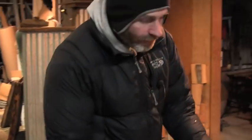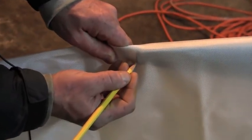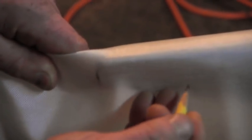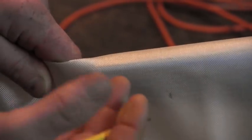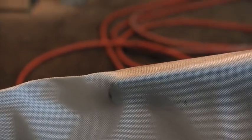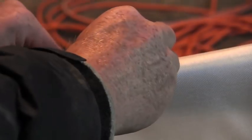Now I'm going to come to the very front of the kayak and mark where the end of the kayak is with a pencil. Then we mark no more than two and a half inches back — this represents the amount the skin is going to stretch. We're going to sew the skin up short and then stretch it tight. I'll go to the back of the boat, unhook the pocket we made in the tail, push it out of the way, come to the front, and pull it to the second mark — so we'll be sewing the boat up about two and a half inches short.